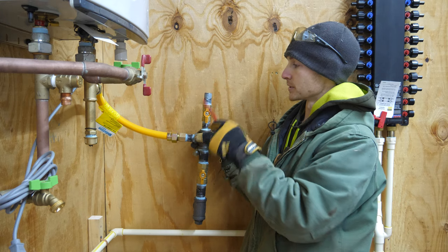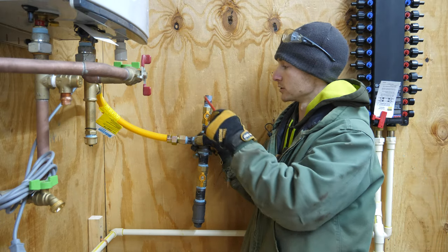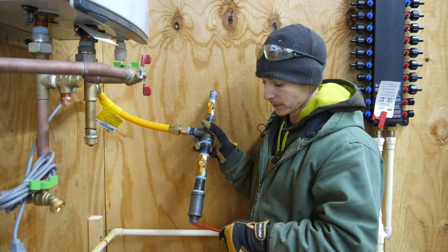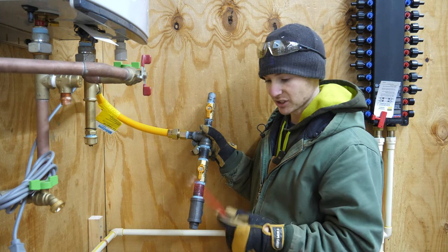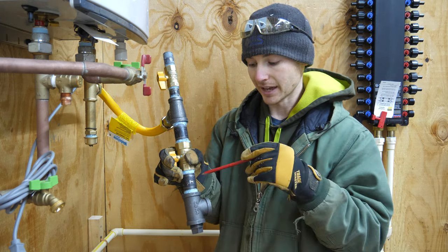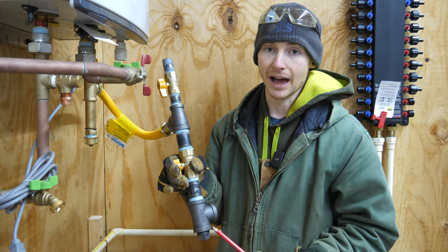The top of this manifold is going to run all the way to our stove on the other side of the house — I'll use a piece of CSST flex line for that. One other thing to note is this manifold is not quite complete. I just have a plug in the bottom but I'm going to be putting what's called a sediment leg or a drip leg, which captures any dirt or debris in the gas stream. When gas comes in through the house it takes a 90-degree turn upward and heavy dirt falls downward, so I'll put a piece of three inch pipe down here with a cap — that will be my drip leg.